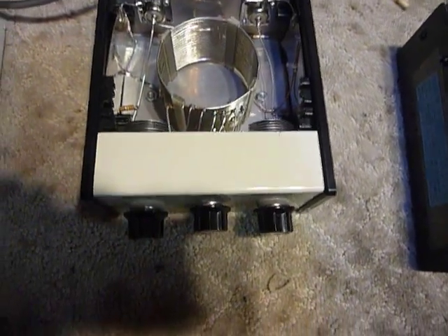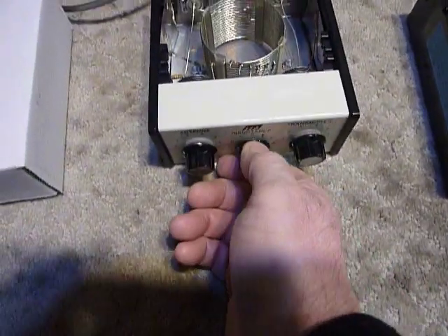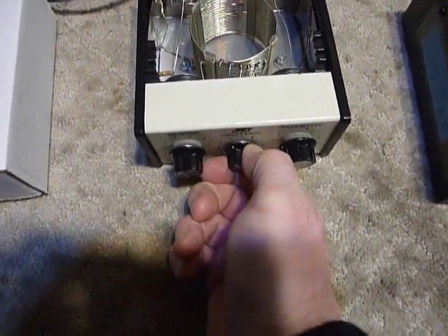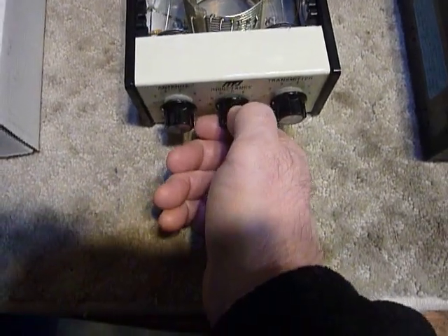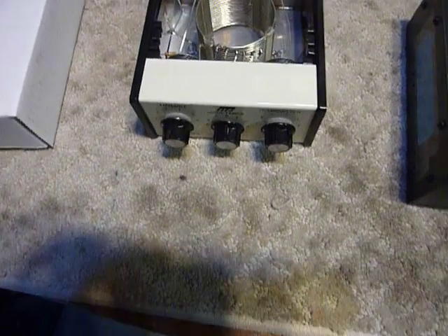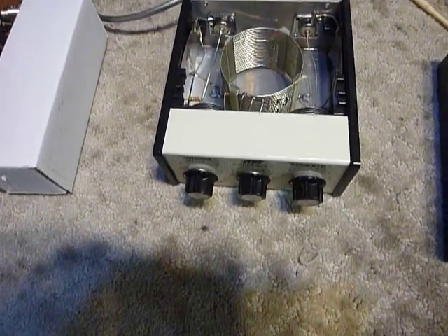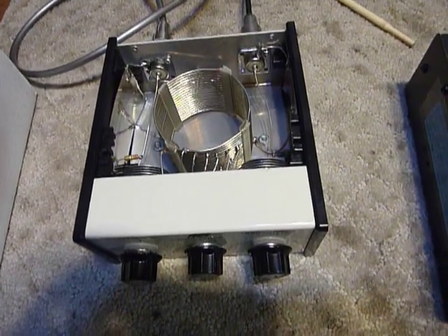If you have another tuner with this kind of rotary switch, remember: if they're not working quite right or if you have doubts, rotate them 25 times in each direction so the contacts wipe themselves clean — that's what rotary switches do. That's it guys, 73s and good DX.